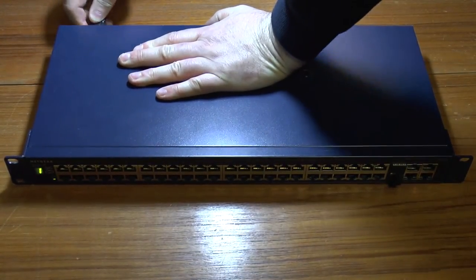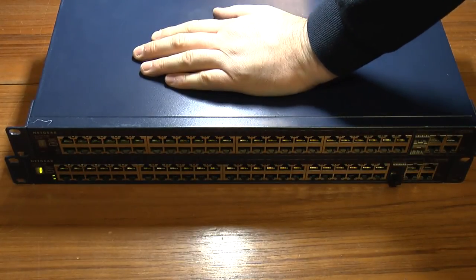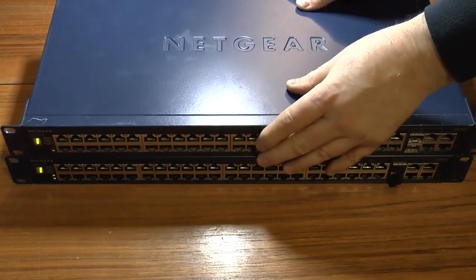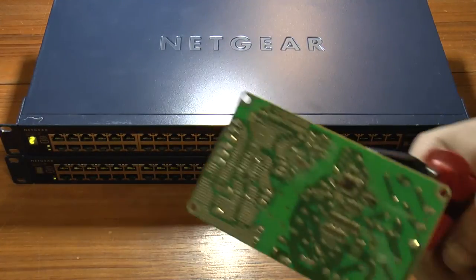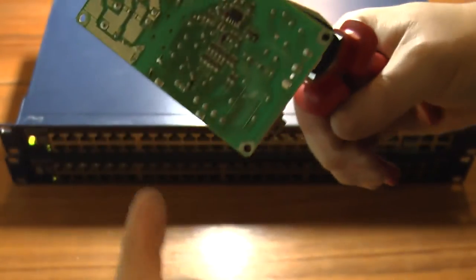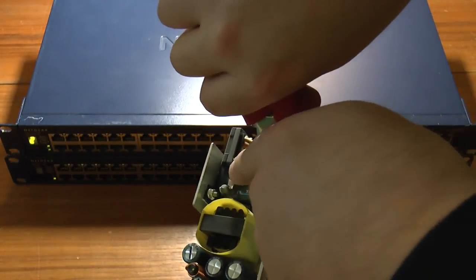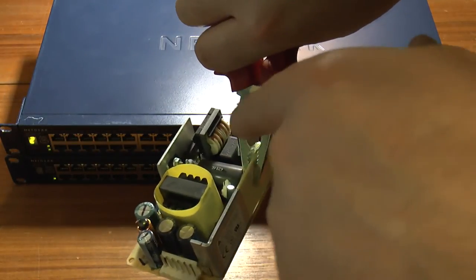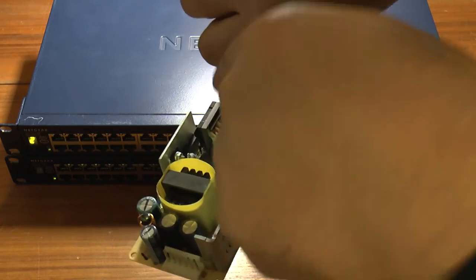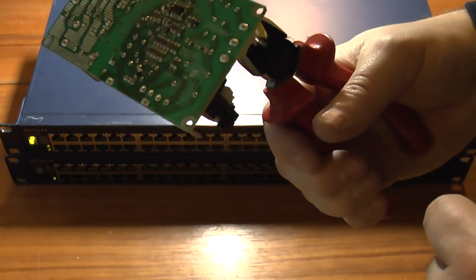There's the switch — plug it in and she's starting up fine. That's the one that worked already before, and this one didn't. Just to illustrate what I was seeing with this power supply: this heatsink is connected to one of the outputs, and this heatsink is connected to the negative side of the electrolytic cap. On this one there's also a resistor across it so it discharges quite quickly. But if something caused it to fail and blow that resistor out as well, there's nothing to discharge the cap — it'll just sit there waiting to bite.